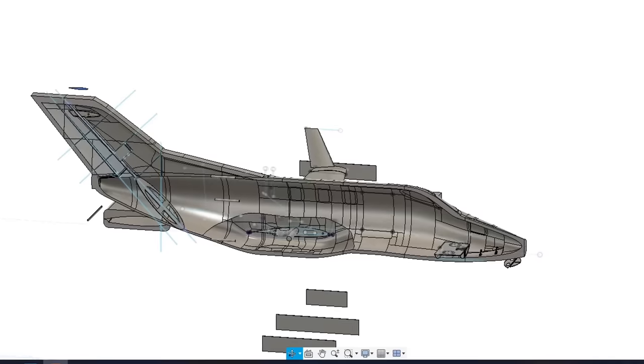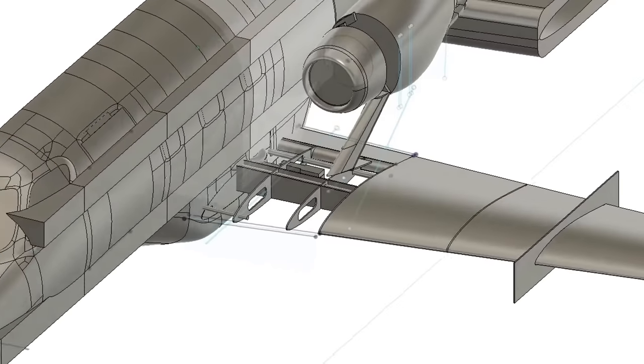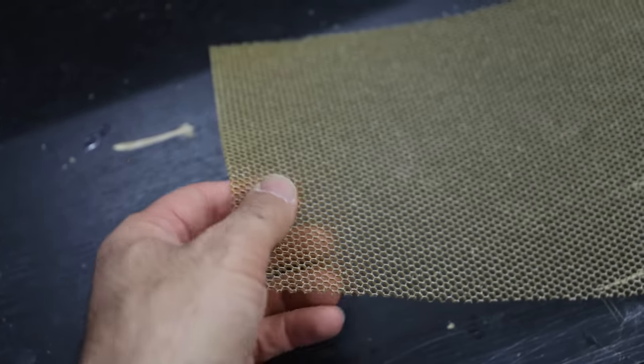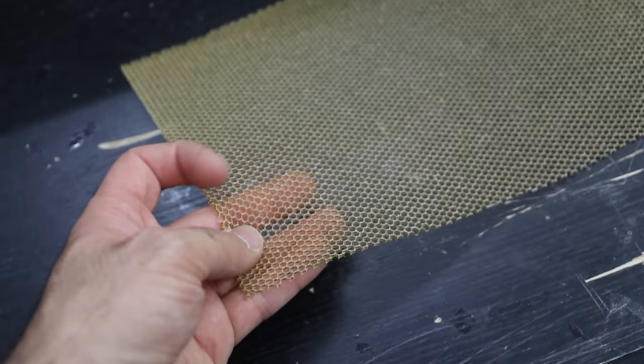So it's gonna be a Honda jet 1:4 scale, which is really big. And of course, as usual, I will be using and trying new materials. This time I will be experimenting with the honeycomb. It's a sandwich material that goes on the skin. It's very light and it gives great strength to the whole structure. So I'm so excited to try all that. Let's get to work.